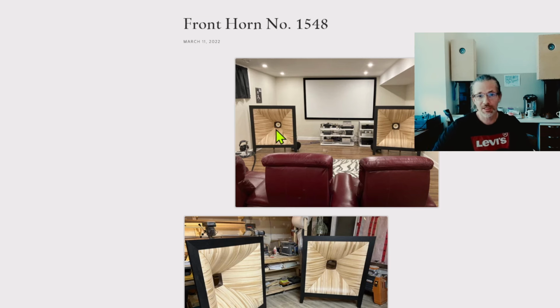And now, is that a problem or not? You will get super efficient sound down to 50 hertz, and that's just absolutely fantastic. And if it's a smaller room, then you don't really want to have the bass extend much lower than that, because I would rather have the extension a little bit limited by the speaker than limited by the room, because when you have room limitation, to my ears, I'm not happy with the sound when the bass response is overloading the room. That's not something that is particularly desirable, at least not for me.